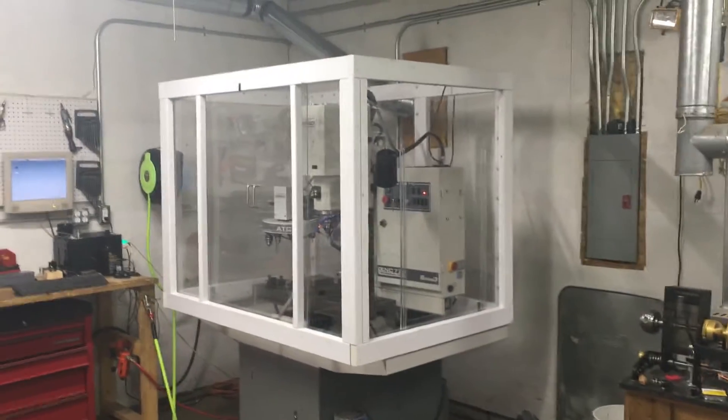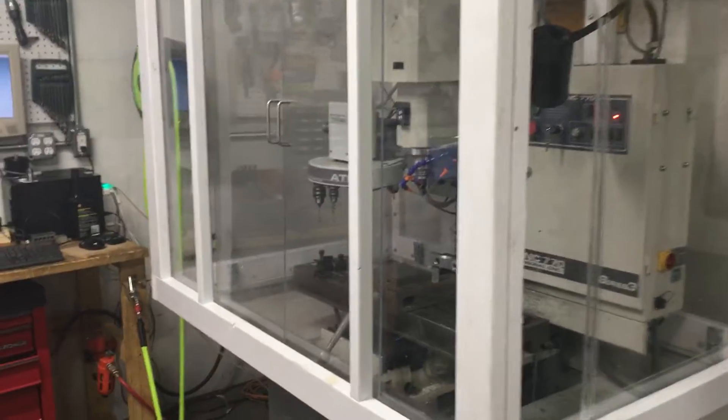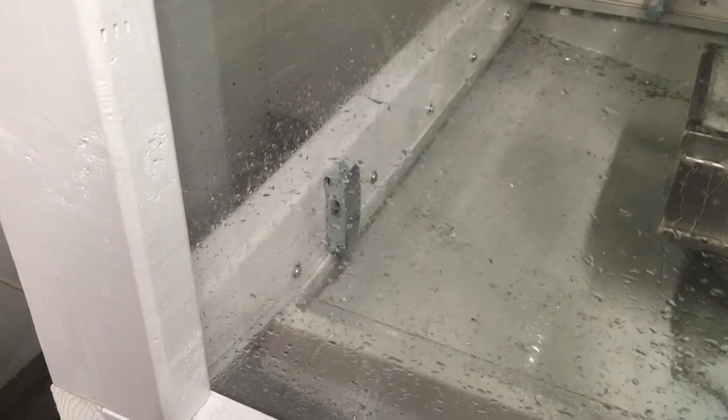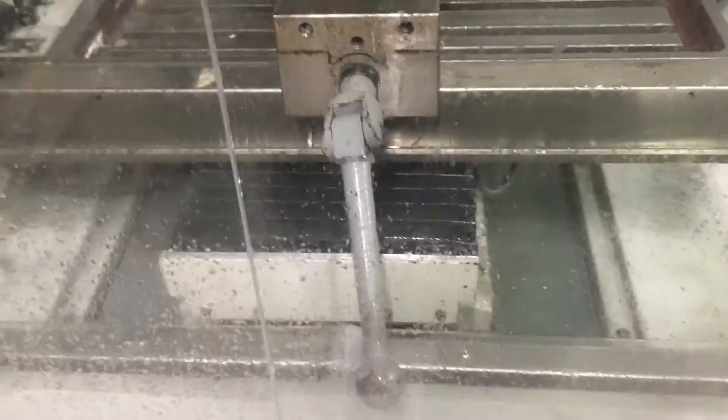This is the enclosure that I built. The diameter, or the outside edges, match the drip tray of the Tormach 770 base. Down in the corner I actually attached it to the base with some metal ratchet clamps — there's one in each of the different corners. I also extended it out, giving me room for the vise so that I have plenty of overhang.